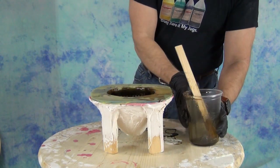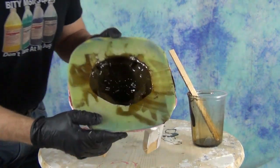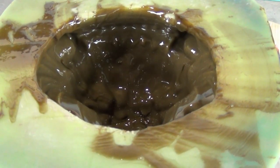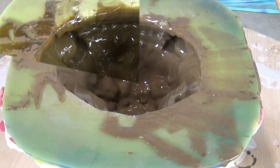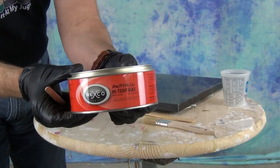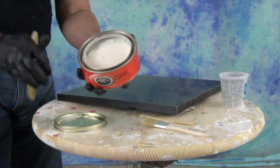You'll notice I'm using the stir stick to scrape off the flange and make it level, and it's important to do that before the resin completely cures — you can see it starting to kick a little bit. If we wait too long and start scraping, we might start pulling up that resin skin. You want to do that step quickly, and once the color change starts, you're ready to move on to the foam casting.